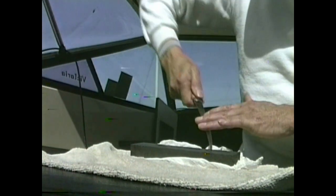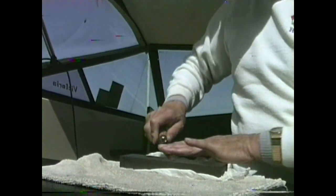So now I'm going to take that burr off. There — there's no more burr there. Now I'm very lightly going to just true this up, sliding my hand along and keeping pressure on all points of the blade. Now I'm going to turn this over and put it on the fine side — a little bit more oil. I'm going to take those rough grindings off. This is a very fine stone and it doesn't cut much. The next time you sharpen, you can just go to the fine edge unless it's extremely dull and you need to grind past nicks or a badly turned-over edge. You don't want to wear your knife out, so you don't always have to use the rough side — just a tune-up every once in a while on the fine side is good.